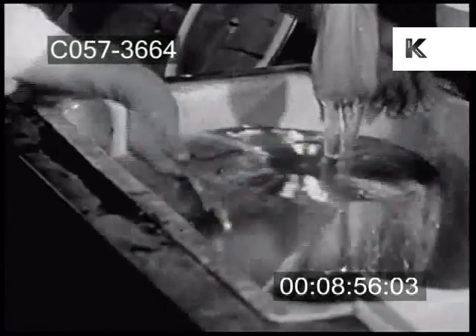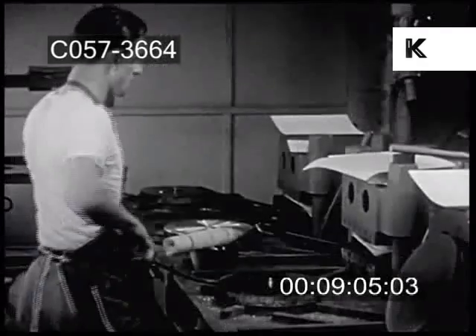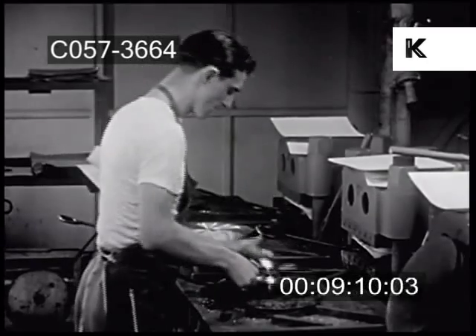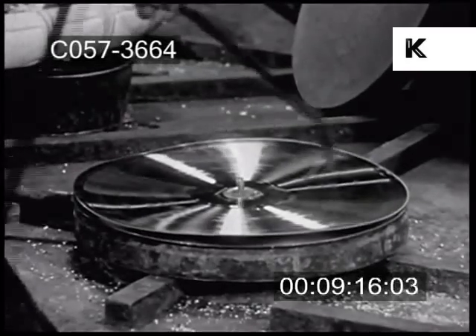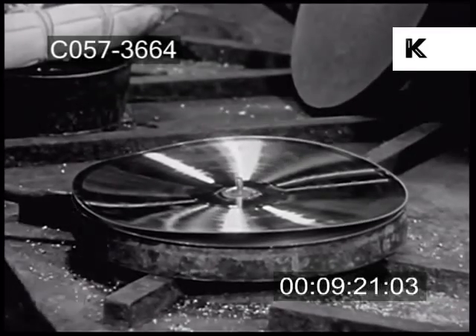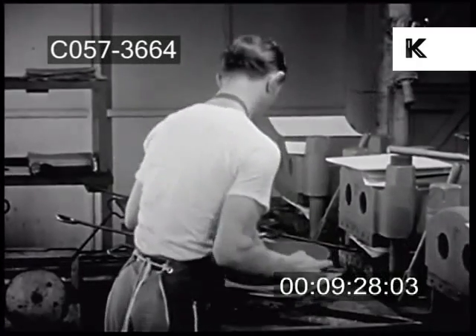The matrix is washed once more, and now with other stampers, it will soon be ready to press the finished records. For still greater strength, the completed matrix is soldered to a rigid backing. For perfect contact with the hot backing, the stamper is heated with flame, protected with a chemically neutral blanket, and pressed evenly into the hot solder.